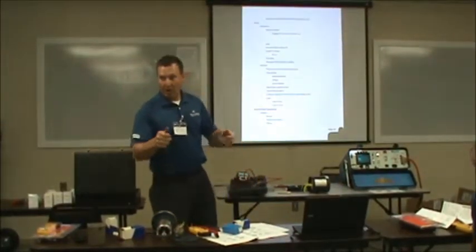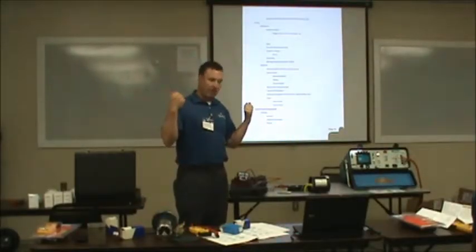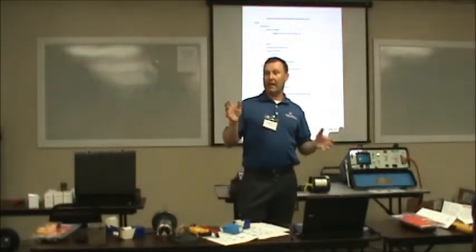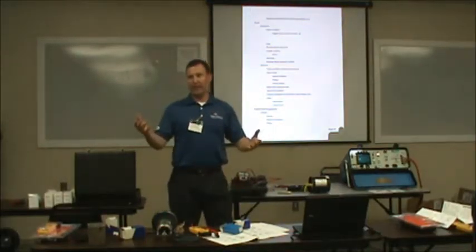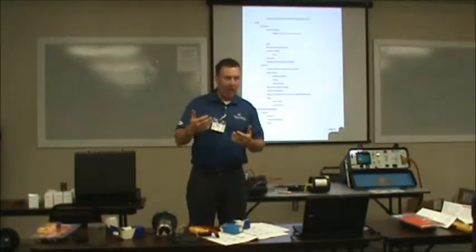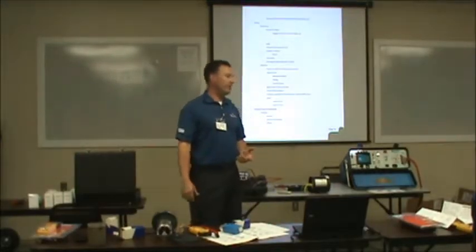Anyways, when you ohm your motors, if you're off balance more than 5%, probably pull the motor, because the readings should be within plus or minus 5% of each other. When you get into bigger ones, you're probably going to see 0.2 ohms, 0.3 ohms, you know, you're going to be reading that. And you have to have an obvious short to pick it up with a multimeter.